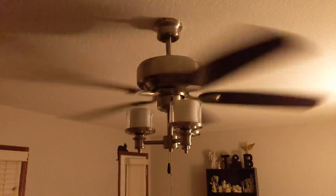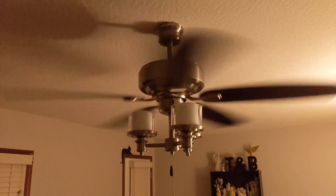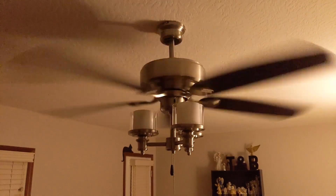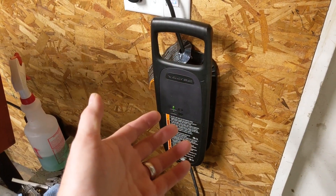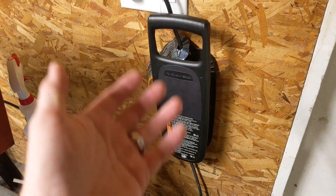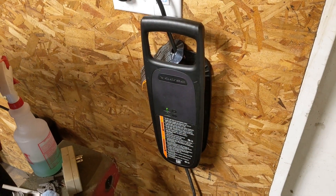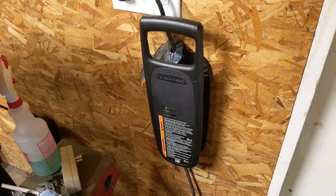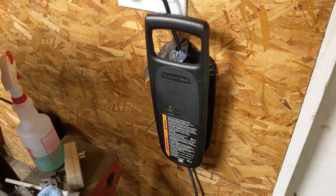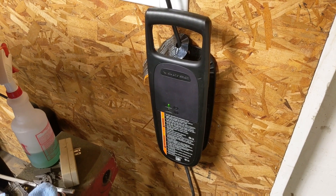It's more of a guess. Sense has yet to find any ceiling fan, any lamps, or any devices that just don't use a lot of energy — so it's not really going to give you enough information to know what every device in your house is using. It also doesn't want to find my car charger — this is a Voltec charger that charges my Chevy Volt. Sense doesn't really see it. I assume it's because it's a variable charge that's constantly adjusting itself as it charges the car, and there's probably no way Sense can see a clean signature from it. So for me, Sense does not do what I need — I actually bought it so I could watch this car charger and determine how much energy I was using. It gave me a rough idea, but not with any accuracy that satisfies my curious mind.